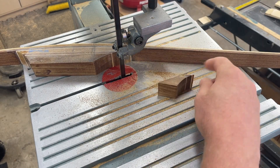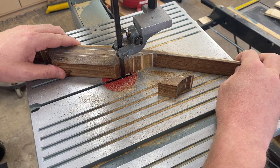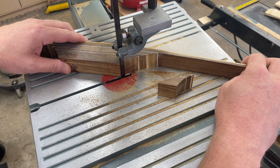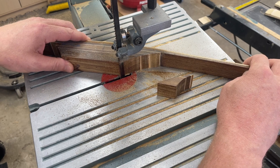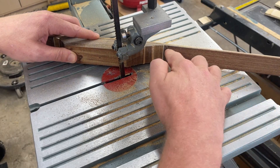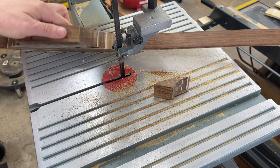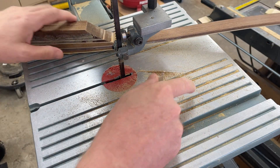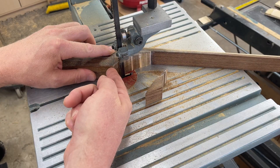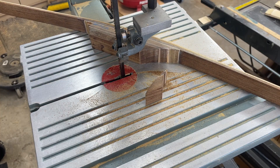Something to pay attention to — if you rewind and take a look, especially on a hardwood, at the very end of that cut everything jumps forward, just like that. That's exactly what went into my belly when I made that mistake. Always cut from your belly to the back of your riser when using a bandsaw to shape your riser fades.